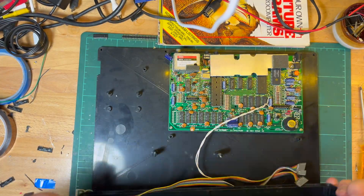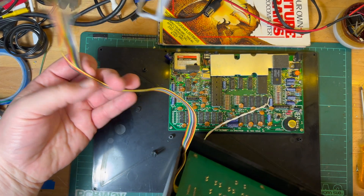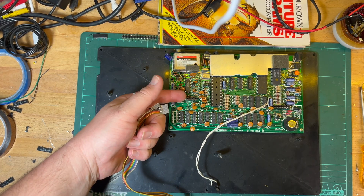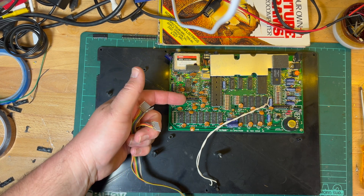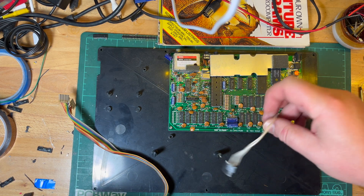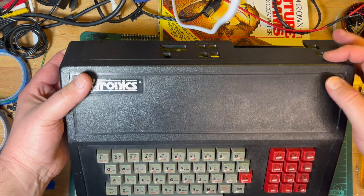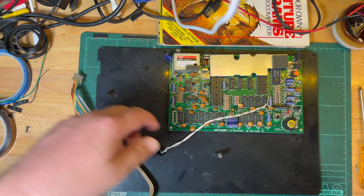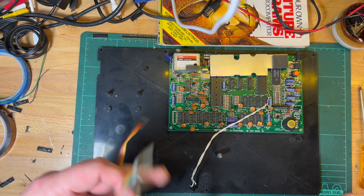Inside: there's your Speccy Issue 4, and here's the keyboard cable — looks to be broken, but that's okay. I can replace it — put some pins and sockets on there and that'll work. There's a reset switch floating around so you could attach that on the back. I'd probably pull this apart and give it a wash. Also, no ULA on the Speccy — that's fine, you can get replacement ULAs.